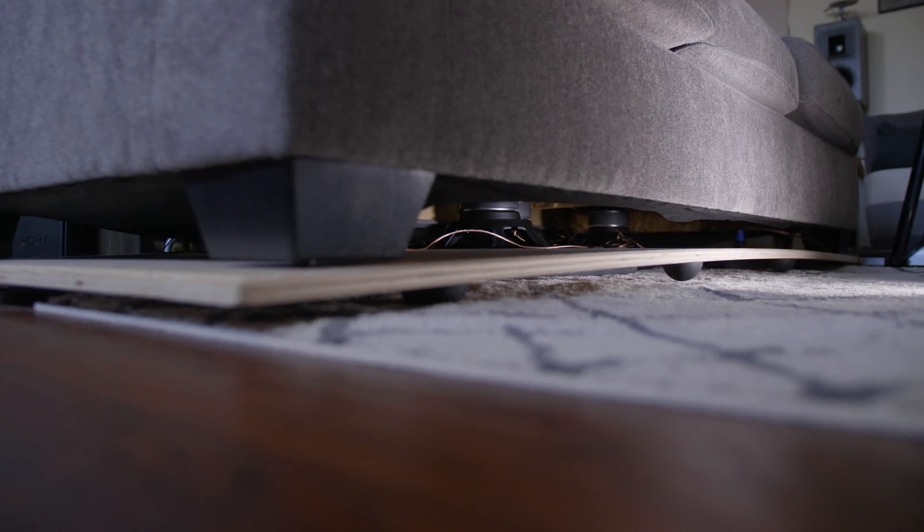Once I had the hover BOSS mod in place I put the platform down and then put the couch on top of it. I connected the platform to my Behringer NX3000 with my Speakon cable. A side note about the amp: the Behringer amps are very loud — if you're not going to have your amp in a separate room or very far away you will hear them. Check out the video I made doing a fan mod to make the amp much more quiet. The amp then gets connected via an XLR-to-RCA cable to the miniDSP. Quick tip: have the input knob on the NX3000 all the way up and lower the gain on the miniDSP, and try to have your sub trim on your AVR in the -10 to -11 range for extra headroom to avoid clipping.